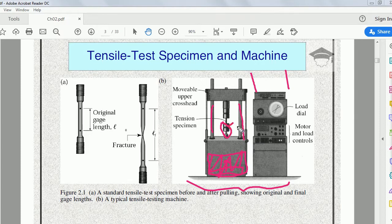This is the fixed portion. We have two chucks that hold the workpiece: the bottom chuck and the top chuck. This entire part is known as the movable upper cross head. When the rails rise, this cross head rises along with them as the load pressure increases, applying force in the upward direction.